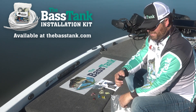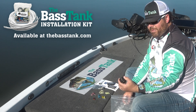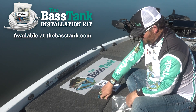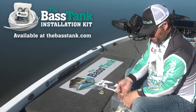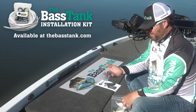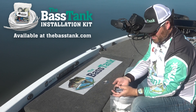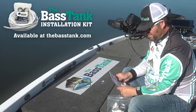We also include three different rubber grommets. We don't like putting cheap holes in expensive boats, but when we have to, we want to dress it up, protect our wires — we don't want anything getting cut there. We've got all sorts of marine-grade connectors in varying sizes to match the units — crimp connectors with heat shrink on them. And then we include the toggle switch — use it, don't use it, it's there, it's yours. Then we've got the jumpers that go on the terminal blocks: two terminal blocks, one for the console, one for the front. And then the brains of the whole thing — the actual wiring diagram — so it makes it very simple from there.